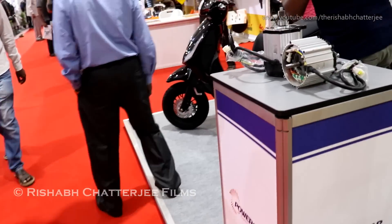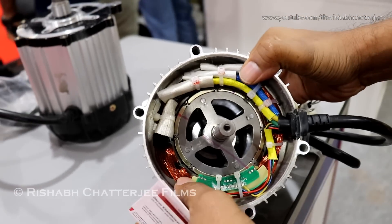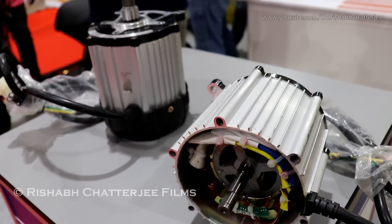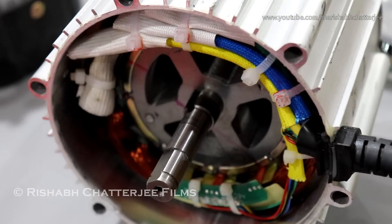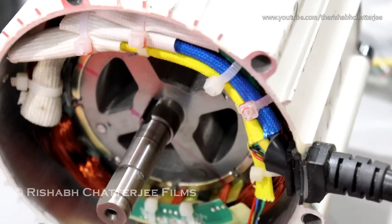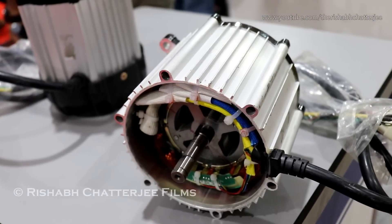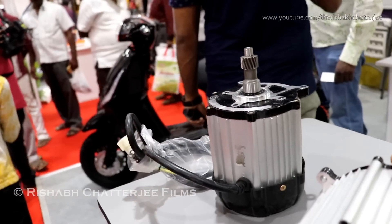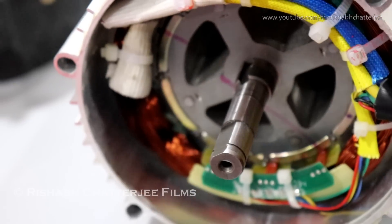This is the 1200-watt motor we intend to manufacture here in India. The magnets are more powerful, and we made sure the plating on the magnets is proper, since water ingress causing magnet rust from improper plating is one of the most common failure points in the industry. We have also used 99% conductivity copper, which is an area where we feel we can differentiate our product.